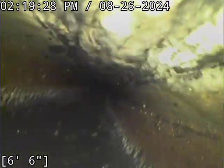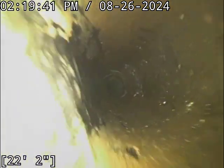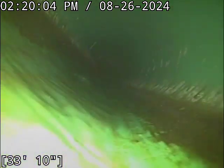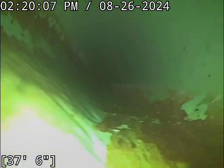I noticed when I got here, the cleanout cap was not threaded in terribly far. Can't tell if someone got some gunk into the cap, but I'll try and torque this thing down a little better. But if you want to get the cap to thread in flush completely, sometimes you've got to get a new cap that hasn't been boogered up over time. I'll see if I can clean the cap up and get it to thread in nicer. I just mention that because these things can trip you up a little bit if they stick out of the ground too far. When they get put in at the very inception, if little bits of gravel and whatnot get into the cap threads, it can mar the plastic up bad enough they just don't thread in nicely anymore. You might see something on my report about that. Depends on how well I can get this thing torqued back in here.